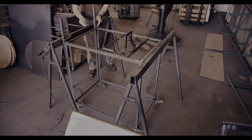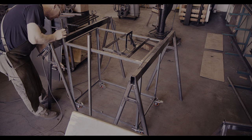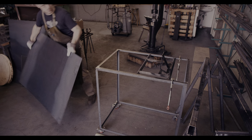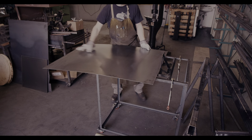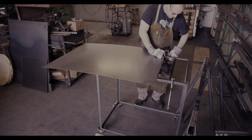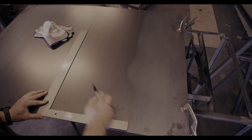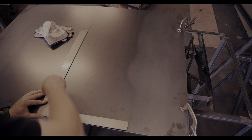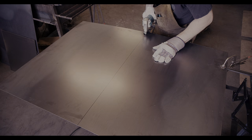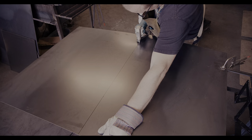At this point, the overall frame is finished and now I need to figure out how to make airtight compartments from sheet metal. In addition to weather stripping, I suspect some silicone caulk may be required as well. First however, let's get back to the challenge of cutting the sheet metal without a brake. I am trying an electric shear here, but the 16 gauge sheet metal is pretty thick, so cutting with the shears is quite slow.